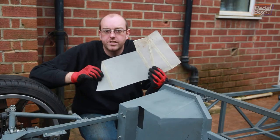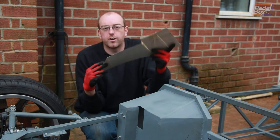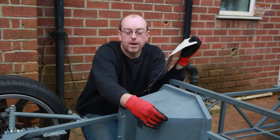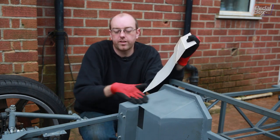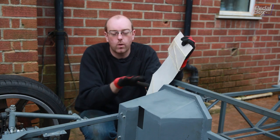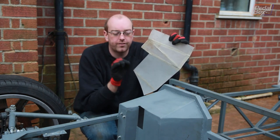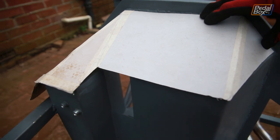This is a pretty classic piece of cardboard aided design, as pioneered by the guys at Bad Obsession Motorsport when they were building Binky. This one's made up from a cereal box that I cut into various smaller panels and then taped together, working from one side to the other. Starting at this triangle I mapped out this size, then this piece across here, and just added them in gradually. I ended up smoothing this so that it was all one piece without needing an extra fold, and you can see how this fits over what we eventually made almost exactly.